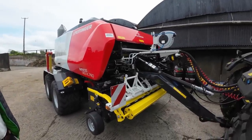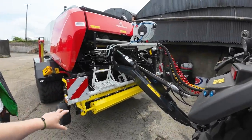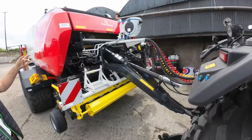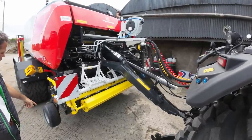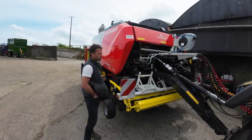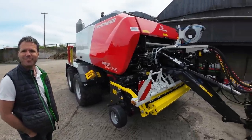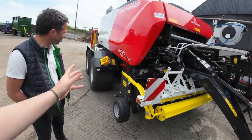The interesting question is how does the belt work in Ireland? People had a bad experience with belt balers in a certain generation and it just blackened the whole concept. We've got the big rail, the big rotor, the blades upside down compared to what we're used to - all of that's good. She can hold two rolls of plastic, or a roll of net and plastic, so if you're switching from one to the other you don't have to get in and out. The knives being on top is what's going to make this work - the flow of grass goes straight in to the chamber. Starting the bale in wet grass is the issue, and that's where this works. If you're trying to finish a bit off when the dew comes down, starting the bale was always your issue, getting it to roll and started.